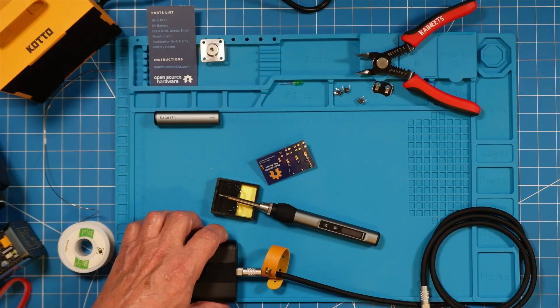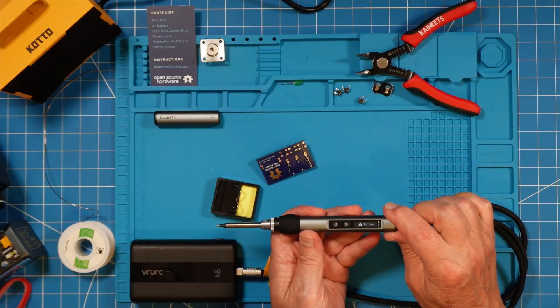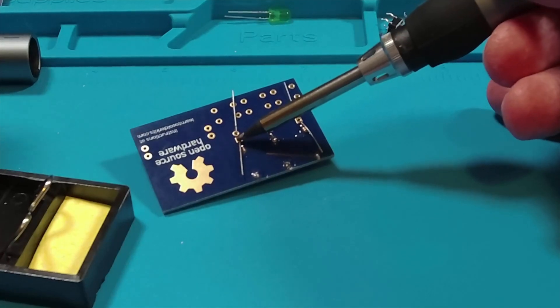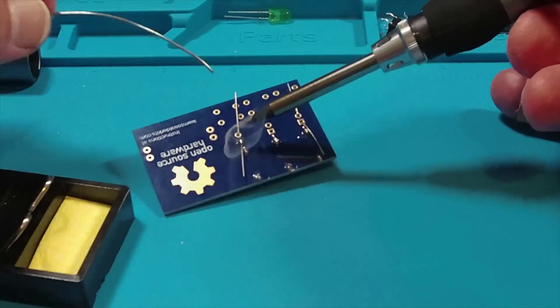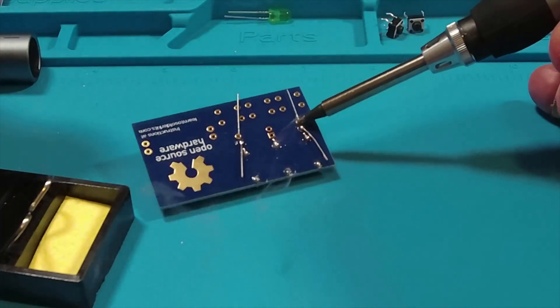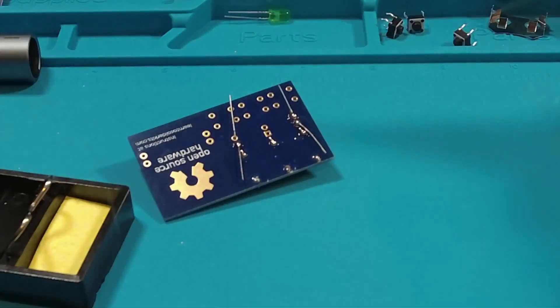Let's move on over to the battery. This is a 9-volt output battery, and as soon as I plug in the soldering iron, I see the Kiwitz logo and a voltage-low warning — because the voltage was set at 20 on the soldering iron from last time, and since my battery is 9 volts, it recognized the power wasn't sufficient to that rating. So I made that adjustment, it quickly came up to temp, and I was ready to solder. Using the battery at 9 volts, I had no problem whatsoever achieving good solder joints. With today's batteries, you can easily get ones that output those 20-volt requirements to use this on the go at full power.